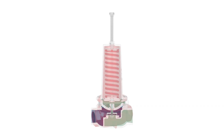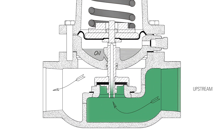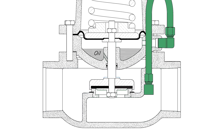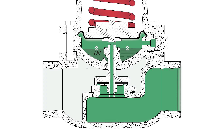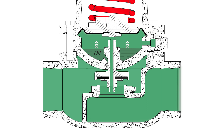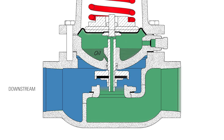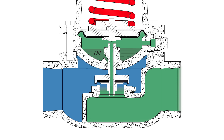Here's how it works. Processed fluid enters the valve on the upstream side. It's communicated up to the actuator chamber, either internally through a stem or through an external tube, depending on the model. The upstream pressure creates a force on the diaphragm and diaphragm plate. When it overcomes the force of the spring, the valve opens, allowing the upstream pressure to release downstream of the valve. As the upstream pressure starts to fall below the spring set point, the valve closes.